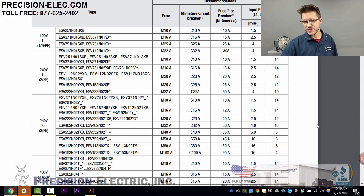The reason the fusing is rated much higher than the rated output current on the drive is because it's rated for overcurrent. We usually recommend fast-blow fuses — that's going to be your ideal protection. A breaker is going to be a lot slower in reacting to an overcurrent situation, and standard fuses can also be slow to react.